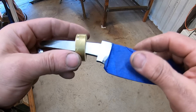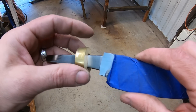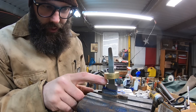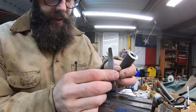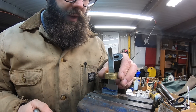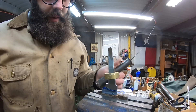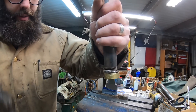I want to get this to where it fits about within a quarter inch of the shoulders, and then I can start applying some pressure to get a nice snug fit. I'm going to start putting some pressure on a little sooner because I wasn't filing completely flat and I've got a couple of high spots where more material is removed elsewhere. I want to make sure things are kind of even and uniform before I really try to take more off.